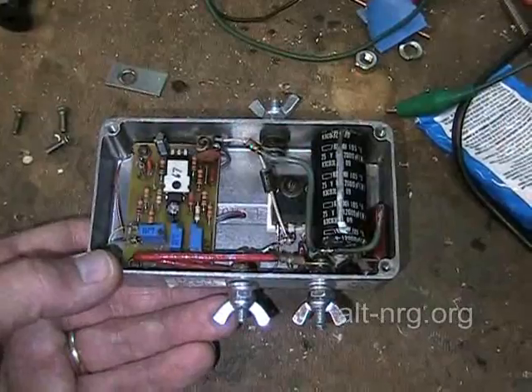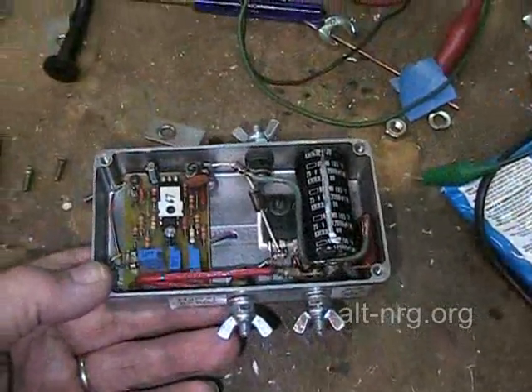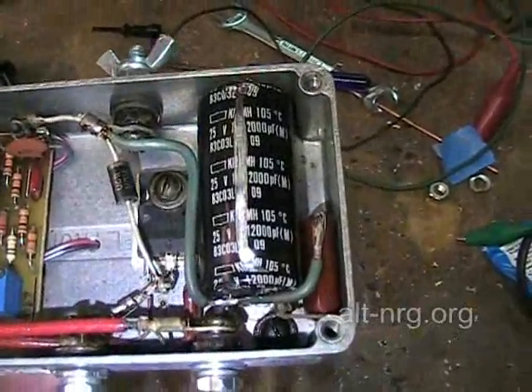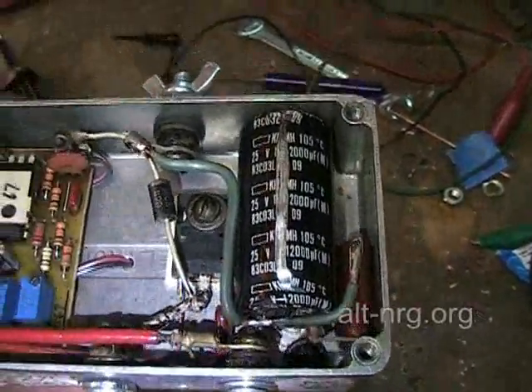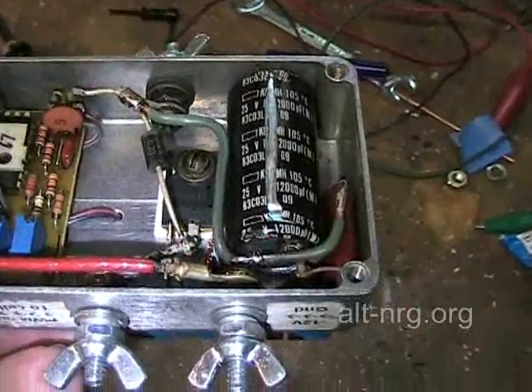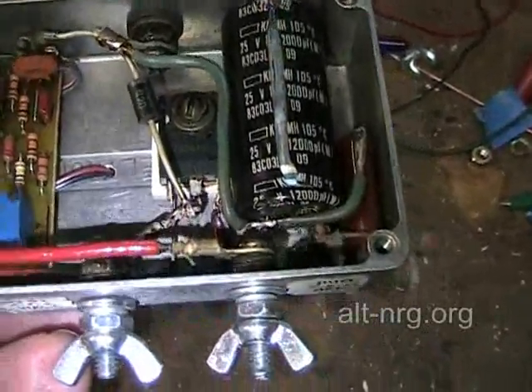In this case, the driver actually replenished the electrolyte and made it too strong. The sequence of events for the failure is: C7 will overheat because the peak impulse currents are so high and that capacitor does a lot of work. So if you drive it into a dead short, that's what's going to happen — C7 fails.